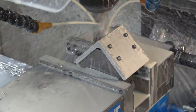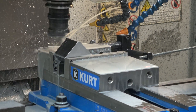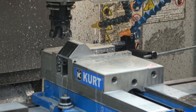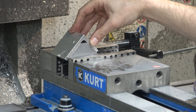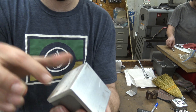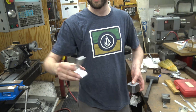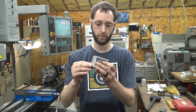That's going to make things way easier. We'll screw it down, cut across here, follow the sides. The main thing is it has to be perfectly square. One of the manufacturing problems was when we use the vise, cut one side, and flip it over to the other side, it's not perfectly square. This is going on a 3D printer slash CNC machine — I think that'll work good.